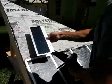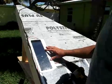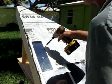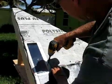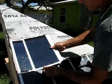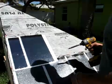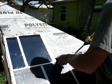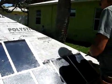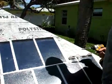This next shingle starts here — we've got one cut in half so it lands in the center of the one below. This is a dummy shingle; it has no wiring in it, it's not powered, it won't produce any electricity for you, but it looks exactly alike. As we come along here, they just clip into one another — there's a little slot it slides into. The wiring is underneath right here where there are no screws, and there's a little void behind the shingle made from the thickness of the film, so the wires are safe, they don't get squashed, and everything is watertight.